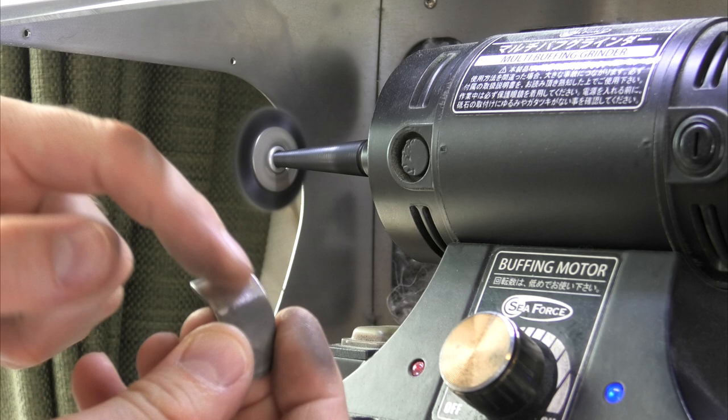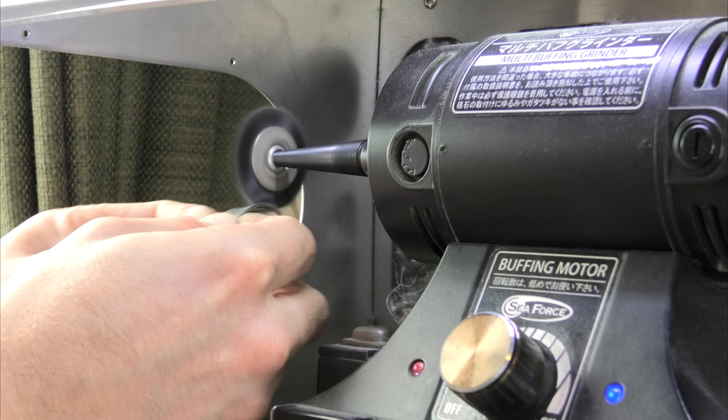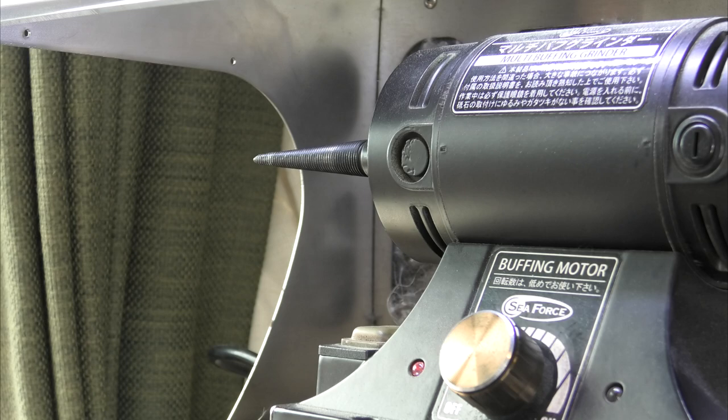You've got to really move things around — go one way then turn the piece around. The way I move it, I think of going in lines: just left, right, left, right, all the way across the surface. That has always proved to be really effective at getting rid of fire stain. Unfortunately the surface it leaves is a bit scratchy and liney — not a nice polish — so you will have to go back to your usual polishing mops afterwards.